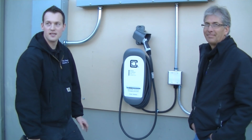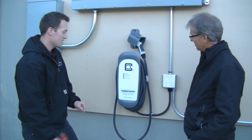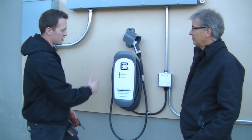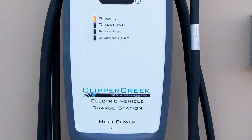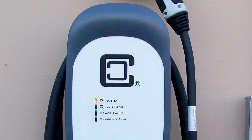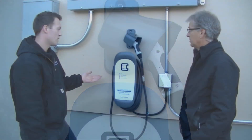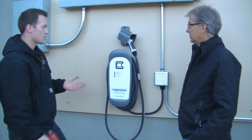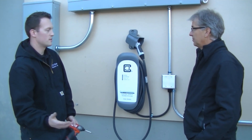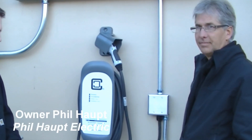And how about only having to find one stud? Only having to find one stud is very nice. A lot of applications require two studs because units are meant to mount at 16-inch centers. This one is just one mount here and one mount underneath, with another mount right above it. Only having to find one stud is really nice, and in a lot of applications you're working with spaces that don't allow you to find multiple studs.